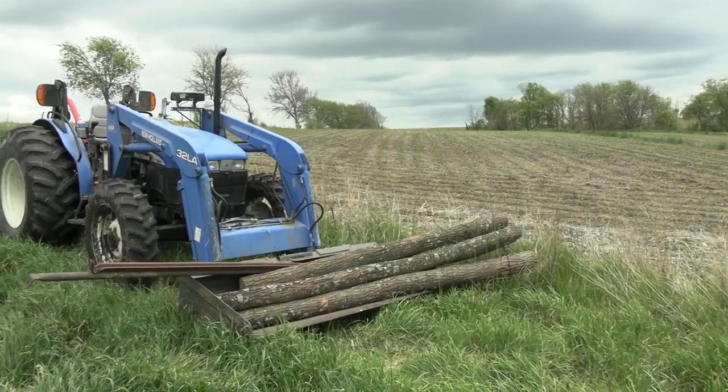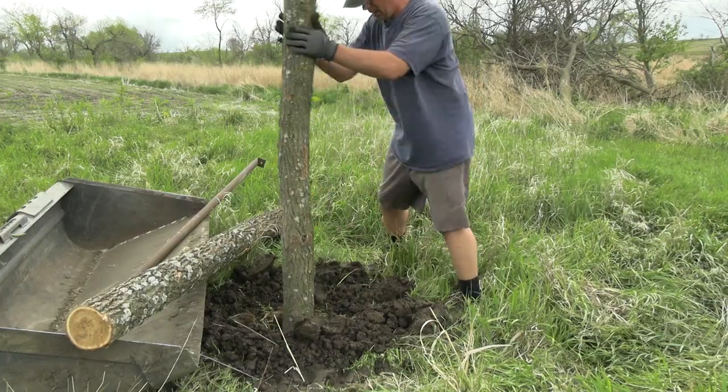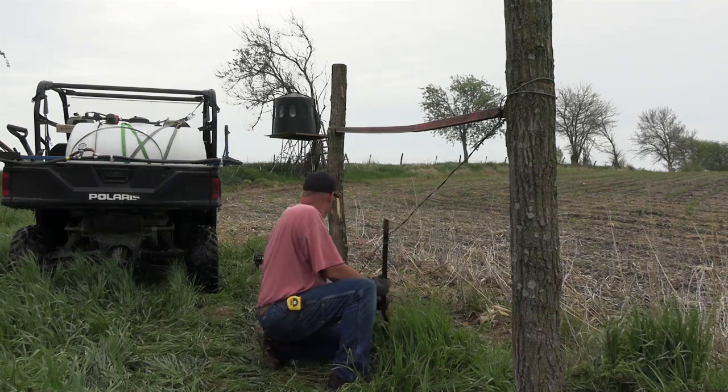When I make these fences, I'll start out making strong corners or very strong ends. I'll do this by dropping four, six, or eight inch treated posts, black locust posts, or hedge posts in the ground, and create that end or corner so I can tighten my barbed wire and woven wire for this fence structure. The key to a good fence structure is creating really good, strong ends and corners.